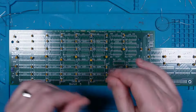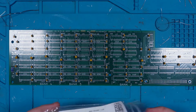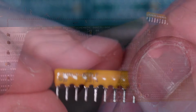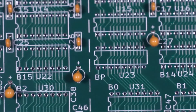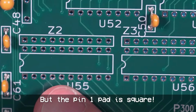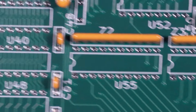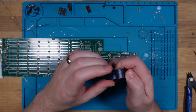Capacitors in. So let's next get the resistor arrays in. I believe there's 2 of these needed, and these are the ones that are here. Again, these will have polarity marked with the little dot on the end here. That is pin 1, and then the others. Now, I don't think polarity is marked. No, it is not on the silk screen here, but I do know that pin 1 is on the left, so they will go here, like so. And I'll just use a little bit of washi to hold them down for when I flip the board.